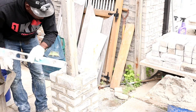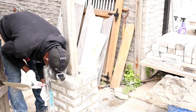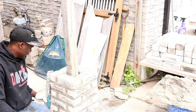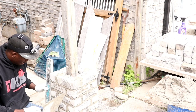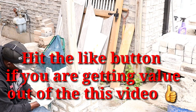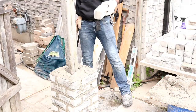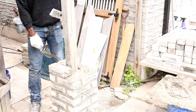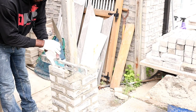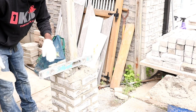Because I'm plumbing it this way, I just plumb it every two or three courses as I go up, so I know I can adjust it. Being that it's a concrete brick, it takes more time for the mortar to absorb, so the joint is not going to get hard real quick. Look, you can see it's still really soft. It's good to level the first two before you put the other two — this way you can put your level across to plumb it, and you get the same result.